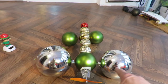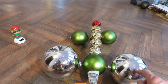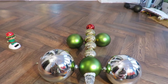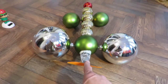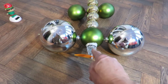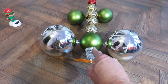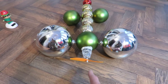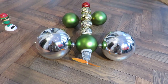The back axle is another bamboo flower cane going right the way through. The wheels are freewheel on there, they're not glued to the actual axle at all. And then this is a handheld fan, normally driven by two AA batteries, but I've actually got a single lithium ion cell in there that I took out of a Poundland power bank. That's a proper propeller on there, so we get the best out of it.